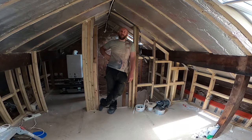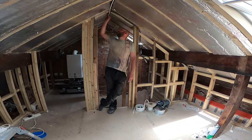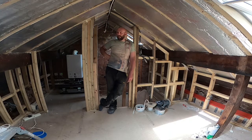This white cable you can see is going to be for smoke alarms. That's hardwired smoke alarms, so that's a 3-core cable. So you've got your live, neutral and a signal cable and an earth. So 3-core and earth. So I've put that in. That 3-core and earth one does need taking back downstairs as well, which is where the hardwired smoke alarms end at the minute. But that's just going to go down there. I'm going to do that one night in the week when I pull up the data cable. So the light, like I said, 1.5 twin and earth.